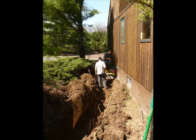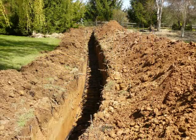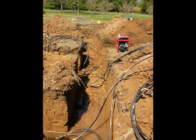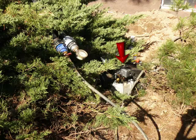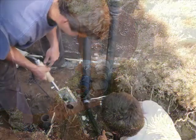That extra coil meant we didn't have to do a fifth coil out in the field. Once the trench is inspected, we can now lay down the feed pipes and the final coil, still six feet down. All the pipes are then joined together at the header — one, two, three, four, and the fifth. Before the final filling is done, the whole coil system is pressure tested to ensure there are no leaks, pumped to 90 psi and held for 30 minutes. No leaks.